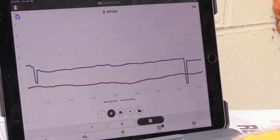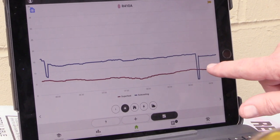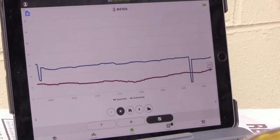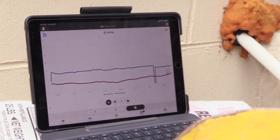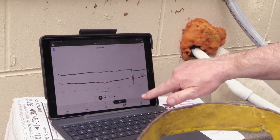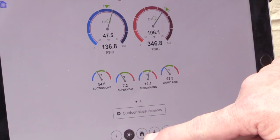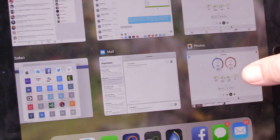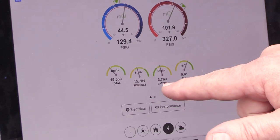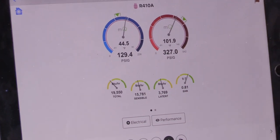Target temperature split looks good. Total, sensible, latent everything is in a nice range. Going to the performance section — we're at 95.8 percent, 95.9 percent, 93 percent of latent load, sensible heat ratio 0.76. System is stable, which means we can evaluate the charge. Weather data shows 87 degrees at 46 percent relative humidity — that's really quite dry for Florida. It did make a substantial improvement. Subcooling is still at 13.6 — I'm going to back just a hair more out, but the closer you are to manufacturer specification the better the machine will run.